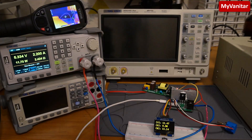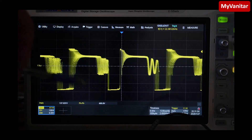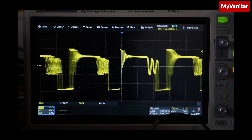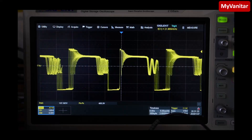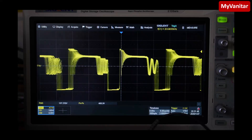I have applied the maximum load to the output. This is the waveform on the primary of the transformer — the worst-case scenario. The peak-to-peak voltage is around 480 to 500 volts, which is still well below 700 volts — the maximum drain-source voltage of the embedded MOSFET in the controller. The snubber is doing its job and keeping the ringing and spikes well below the maximum MOSFET voltage. There's also some jitter visible, which is a natural feature of the controller to reduce EMI.